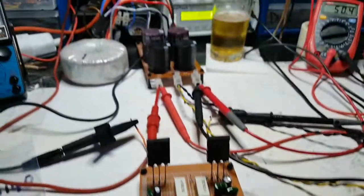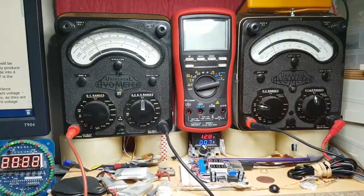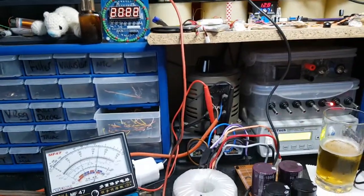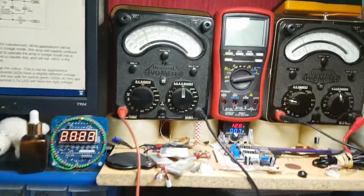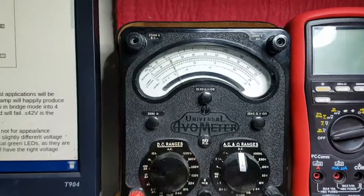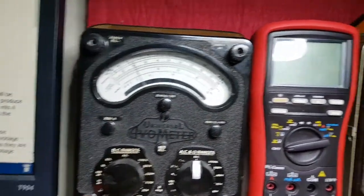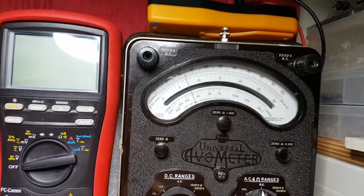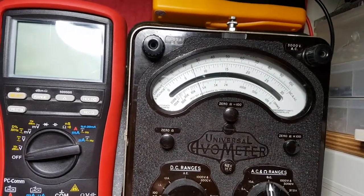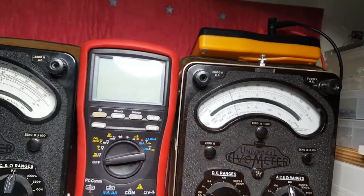Okay, I think it's settled now because it's not actually rising anymore on the quiescent, and now I need to just turn it up slightly because I need to have it above 20 milliamps. And so I just have that there. If I'm going to put the other one on 25 here, but this is only at 50 volts, so I can't now set this up and start trying to do anything at 70 volt. And I'll show you why.